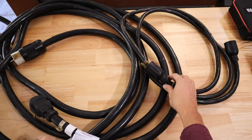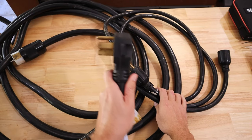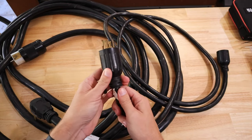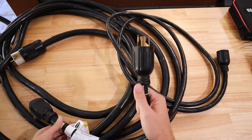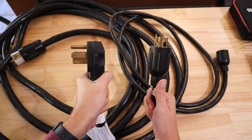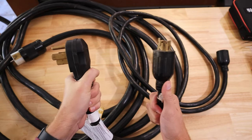If it's a 50-amp it'll look the same on both sides, but if it's a 30-amp they'll have the dryer plug on one side. Then they'll pick up off the internet — or you can actually buy these in store — a 30-amp male plug, put it on the other end, and they'll have a male-to-male cord. This is incredibly dangerous.